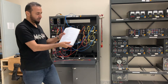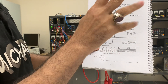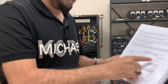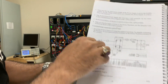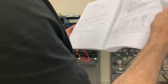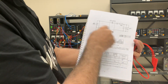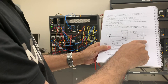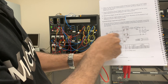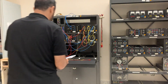This is the new circuit. I will just change two wires — that's the only difference. The previous circuit went from the load to the neutral. Now we will go from the load to the bridge, and then between the two thyristors we will go to the neutral. That's the only difference.